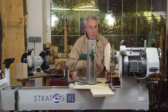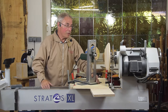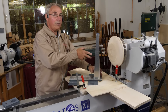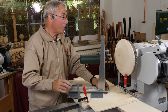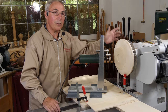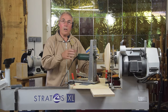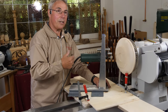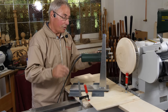So what I've got set up at the moment — I've got the index disc set up. Just one word on safety: in the instructions, and I do recommend it, when you start using this system, get into the habit of switching the router on and off. I have done it myself occasionally — you try to start the lathe up, and because you've got the spindle locked, that can do a lot of damage to the disc and to the index arm. So I recommend that you disconnect the power from the lathe. Don't just turn it off — actually disconnect the plug from the main supply, and then everything's safe and you can't do anything wrong.